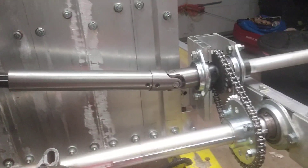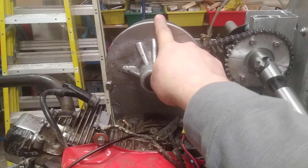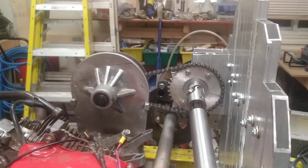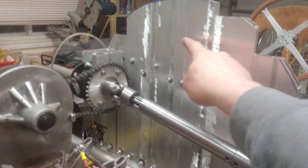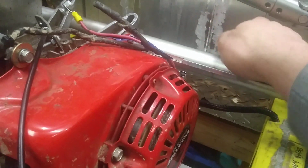What I have left to do is put braces on my backrest. I'm going to support the backrest with a piece of aluminum that goes from there to the torque tube, basically to keep the backrest from flexing. You can see when I push on it, it moves quite a bit and loosens the chain. I'm also pondering going from the motor to the backrest with another flat piece, and possibly from this motor support out to the backrest just underneath the axle. I'm going to have to see how things fit.